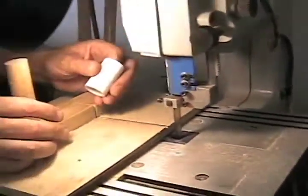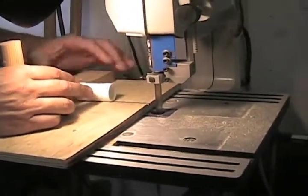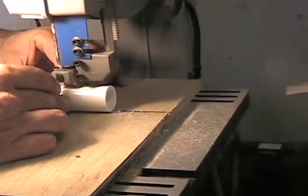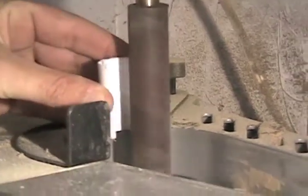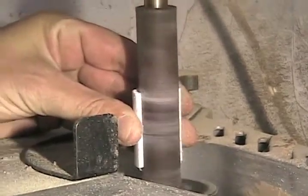To create what is called the bird — the part that is going to fit over the channel of the air — we take the coupler and slice it in half. The PVC coupler has a little seam in the middle which has to be removed completely flush in order for it to work as a bird. You can use a file, sandpaper, or a pocket knife. I use a sander, which allows me to get the inside perfectly smooth.